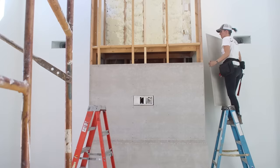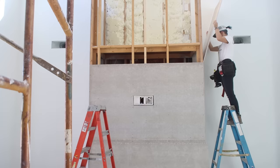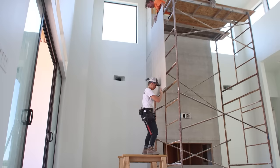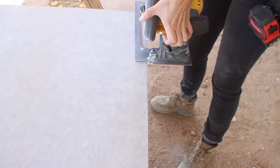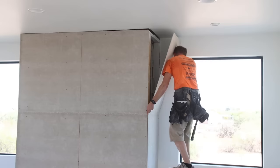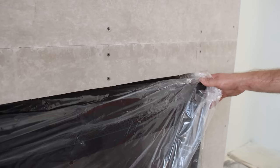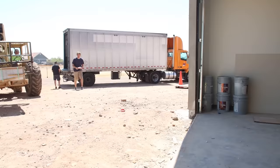The large four-by-eight sheets were nice because they covered so much square footage, but once we started working higher than we could reach on ladders, Bryce had to climb up the scaffolding, which meant I had to get the full sheets up to him by myself — which was actually really hard. Once the entire 19-foot tall fireplace was skinned but before we added the decorative panels, we did a test fit of the electric fireplace insert. Turns out the opening we had framed was about an inch and an eighth larger than needed — luckily an easy fix with some leftover framing lumber.